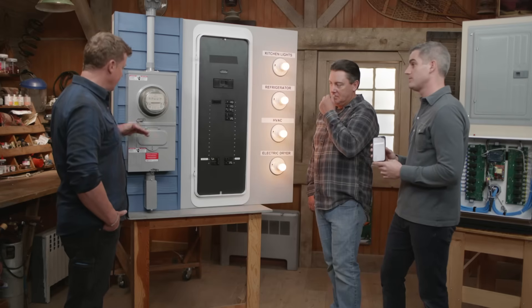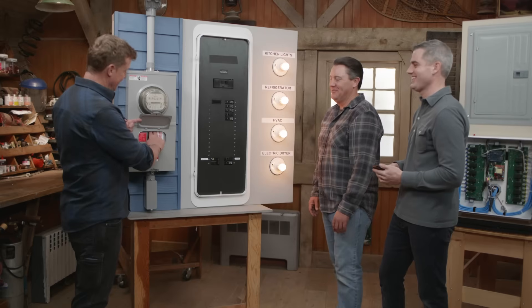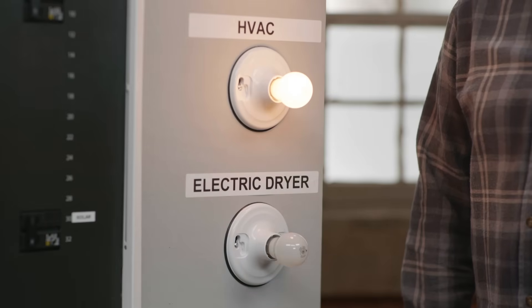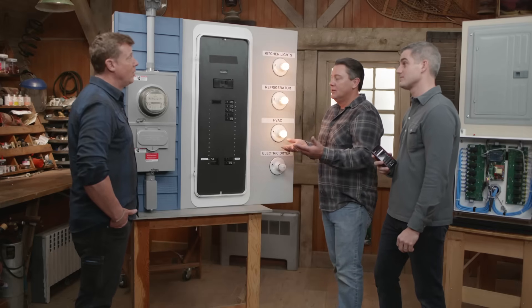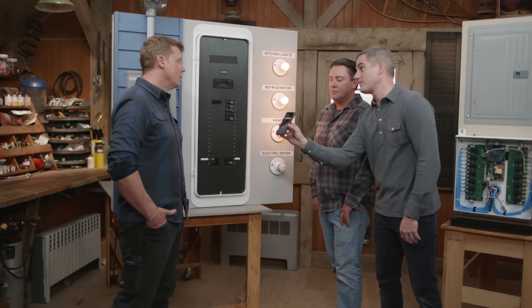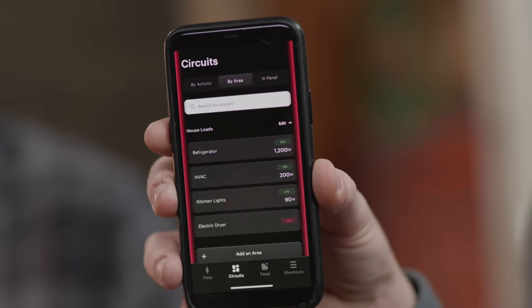So if this were to get shut off right here — can I shut it off? Absolutely. So this is a power outage. And there it is. Because you told it just turn that off — that's a non-critical load. It takes about a half a second to shed those loads. With being on battery, you have roughly a 20 to 30 millisecond transfer time. So you don't really notice lights blank, clocks don't go out, you don't have to reset your router — it's a pretty seamless transfer. You can see on the app that the electric dryer dropped out, but the rest of the loads are active.